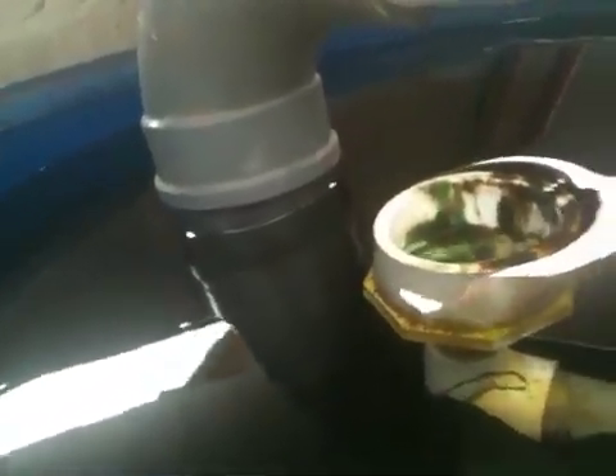It means that the mineralization system is working, which I showed in some previous videos. One interesting thing I noticed: that's where the water leaves the mineralization tank at the top — it goes out this pipe here, and that pipe empties into the bottom of this degassing chamber. You see those bubbles coming out of the pipe? Those bubbles are from gases or air that's either dissolved in the water or entering at the siphon over there. I also have air being injected here to help the degassing process, so I wonder if that gas is coming right out of solution as it enters the degassing chamber.